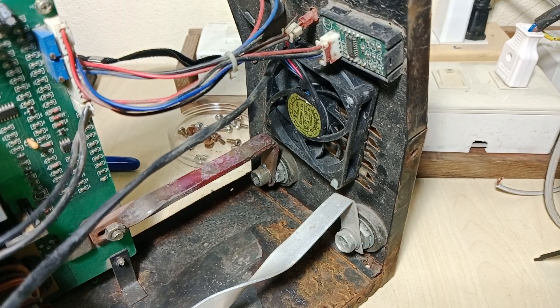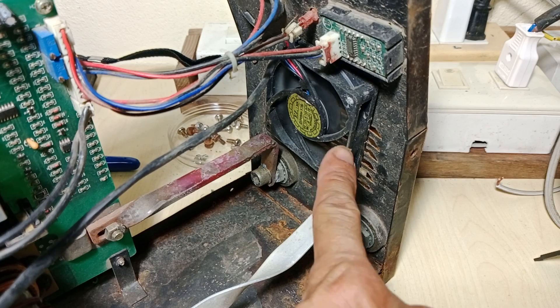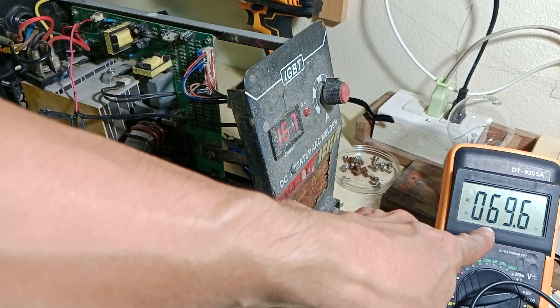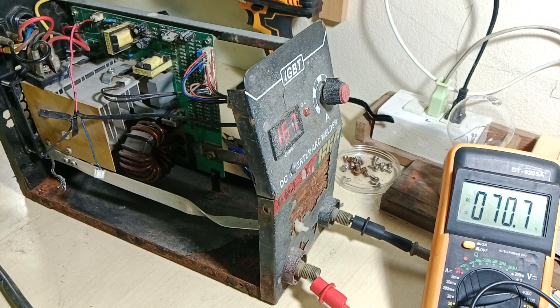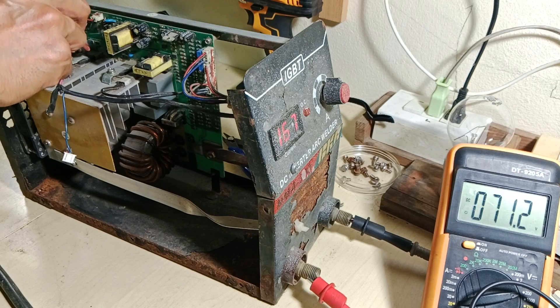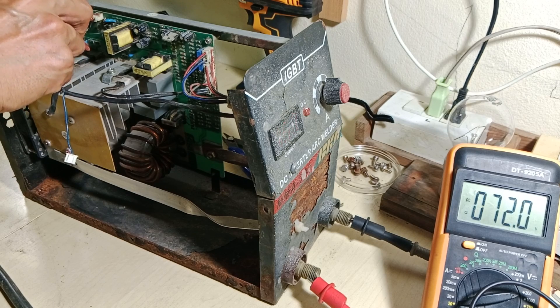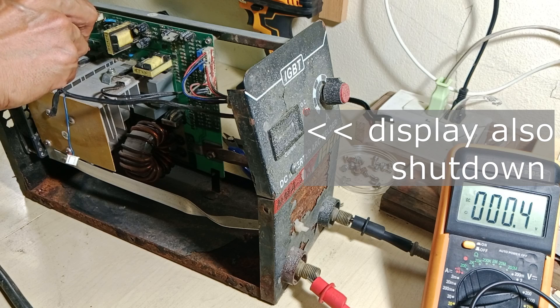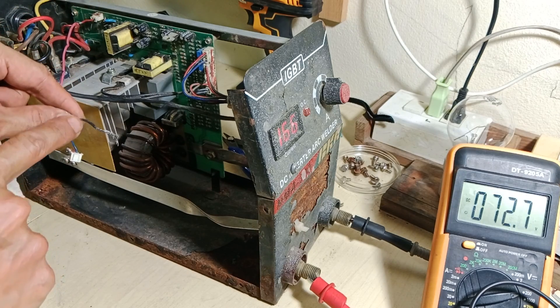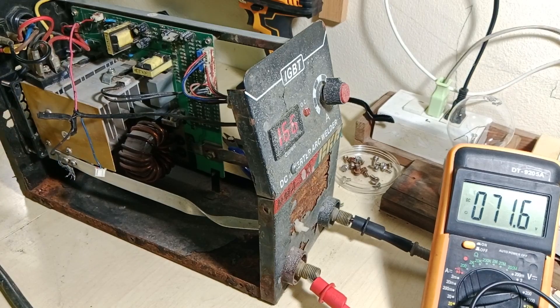When I plug and turn on this inverter welding machine, the small extra fan works, but the welding machine has no output voltage. I tried to disconnect the power to the small fan and now there is output voltage. The output does not look stable and a bit too high, but we will look into that later. Now I'll show you what happens when we connect the additional small fan — you can see that the output shuts down. So the main problem with this unit is the owner himself; the extra fan caused the inverter welding machine to malfunction.